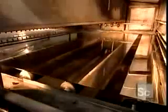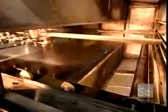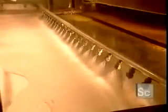Within seconds of interacting with the tin, it hardens. And as it does, you begin to see a reflection. It's this silver backing that transforms clear glass into a mirror. Sprayers rinse off the excess silver, which gets recycled back into the system.